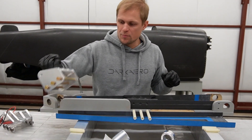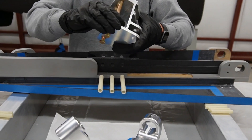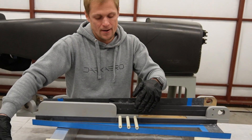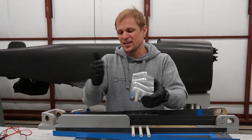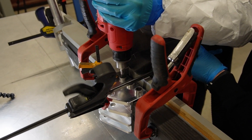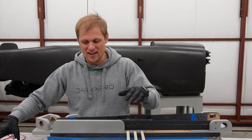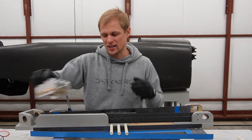There's another piece that's not bonded — it's just bolted to the strut in the middle. This is called the strut bracket, and it's held in place mechanically fastened with a couple of large bolts. We had to match drill some holes running through here, and the holes had to be perfectly aligned. The way we achieved that was with a drill fixture — a scrapped strut bracket that we repurposed. We clamped it on the strut and drilled holes through so they were perfectly aligned. Any misalignment would mean the assembly won't go together properly or transfer loads correctly.